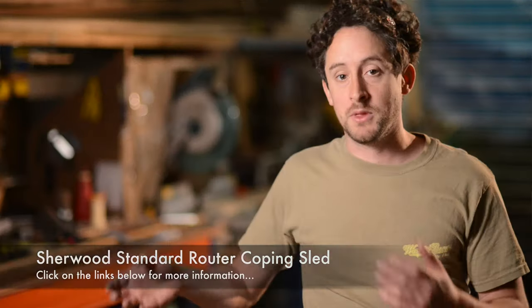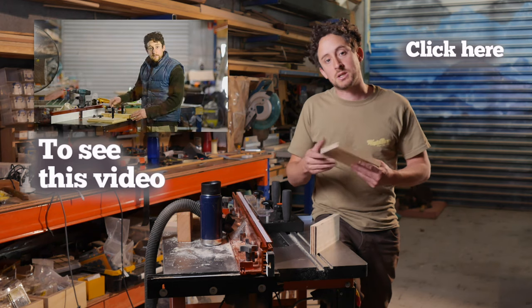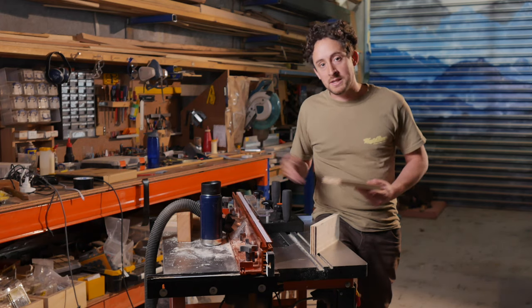Coping jigs can operate in a number of ways. The one that we built — and there's a video to build it yourself — operates slightly differently from this. You placed your timber on top of the jig and then the jig referenced off the miter slot. A couple of problems with that: putting the timber on top of the jig means you have to account for the thickness of the jig in your cut, which means you have to raise the bit up higher than normal. It's more challenging to reference than just referencing off the table surface. The second problem is when you're sliding the jig along the miter slot, you can no longer use the fence to set the depth — it's really challenging to get the fence and the miter slot to align perfectly.